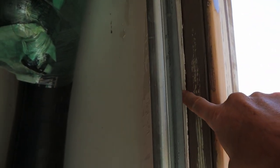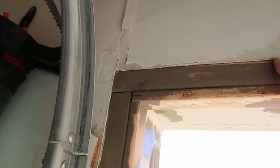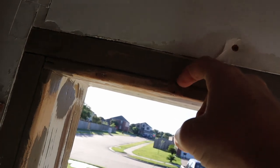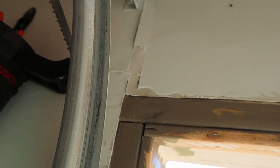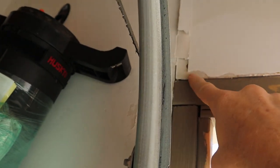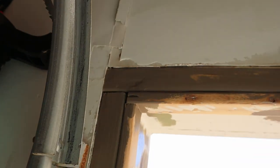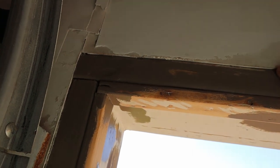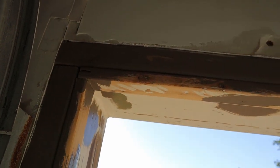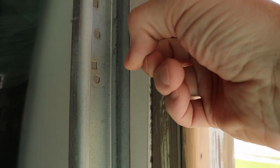Today we've got to tape off all along here because we're going to caulk. I'm going to caulk here, and also right along where this drywall meets — as you can see, it's peeled off and the drywall mud has come away from there because I sanded it. So I'm going to caulk along here all the way across and the same thing down along here. Then when I paint, this back in here and this edge of the drywall are sealed off so water won't damage it.